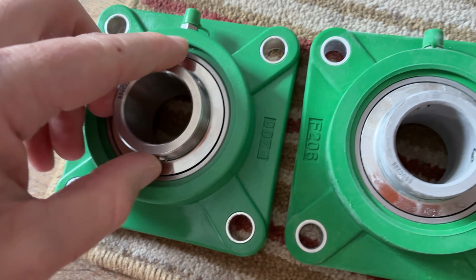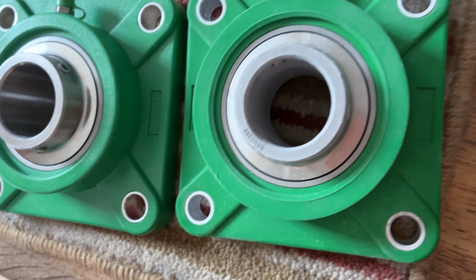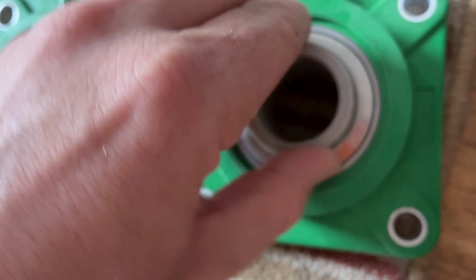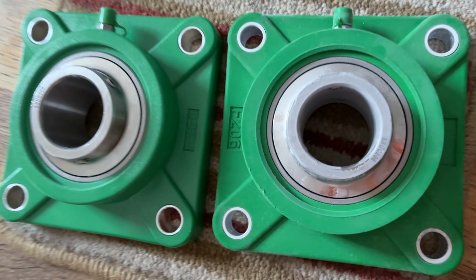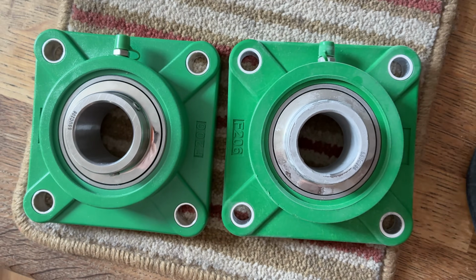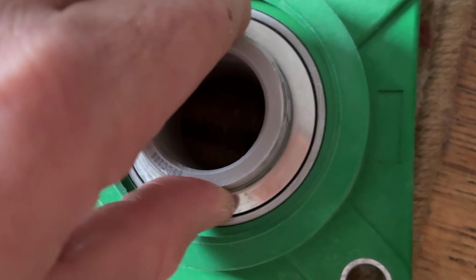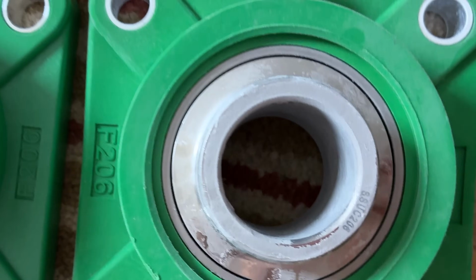Something's up, so I put it in my domestic minus 20 degree freezer. This was the result. Warm on the left, frozen on the right. A shocking betrayal. I've been stitched up like an Arctic char. Heads will roll, but only very slowly if using this lubricant in the cold. We have unsanctioned friction. That oil has thickened up, and whilst admittedly smooth, is not doing its job properly, so we need to change it.